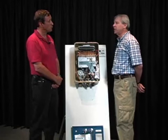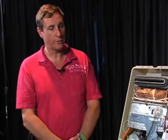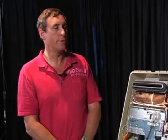And when you say reduction in flow, that actually means reduction in flow, not that the water will get cooler like it does with a conventional water heater. That's correct. When a conventional water heater runs out of hot water, it's done, and until it comes back, it's cold water. It's no longer hot water. Tankless water heater, the more modern, the newer units, what will happen is that flow will drop, yes.